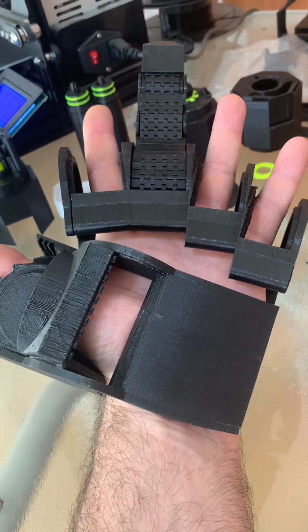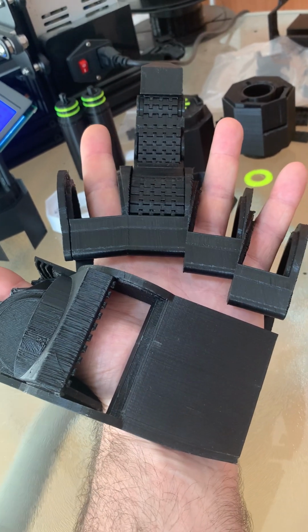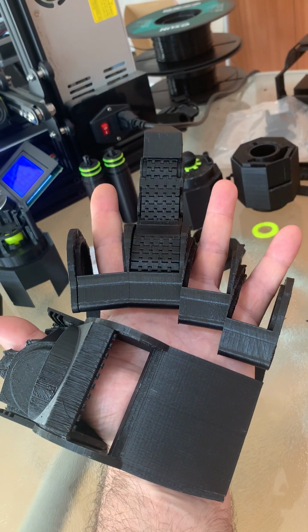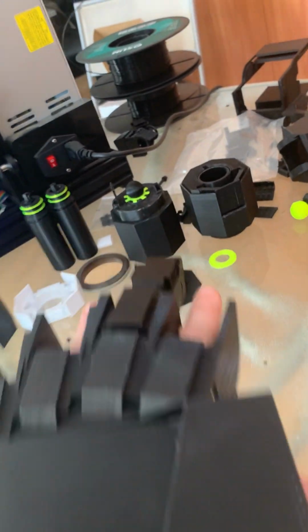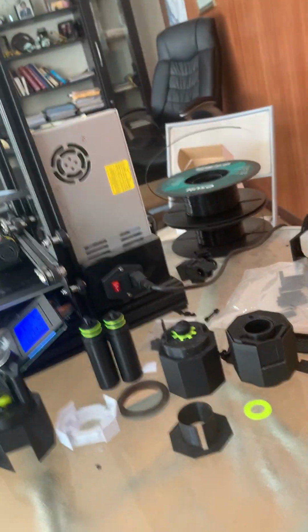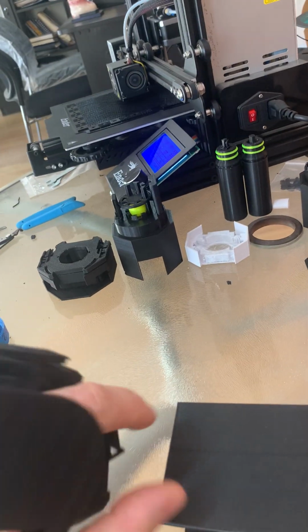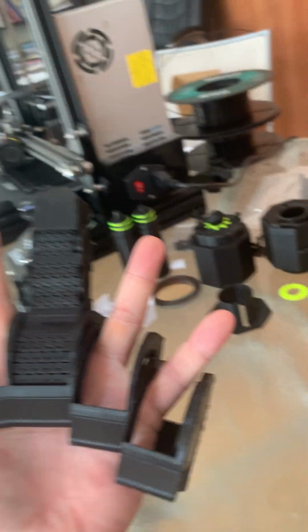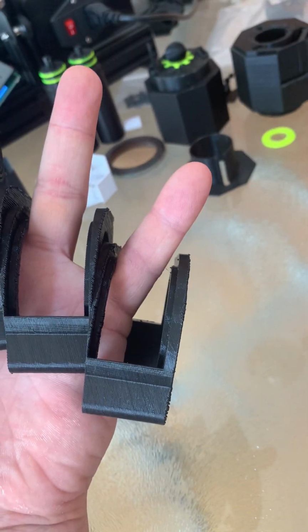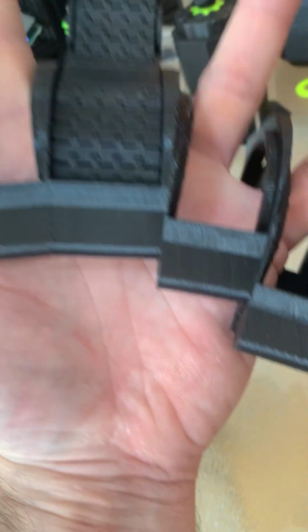Then after that, the first iteration of the glove, again from the video of my nephew, I've actually angled the fingers away from each other at 4 degrees. And this clearly wasn't enough, as you can see from the pinky finger. If I take off the thumb and push this all the way down so that this gap is a little bit more closed like it should be, that's a much more acceptable tolerance, but by no means enough. You could really see that my baby finger is not aligned with its slot, and that's not going to work out very well. So that needs to be fixed.